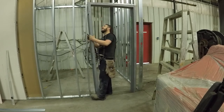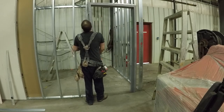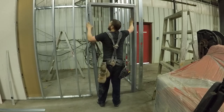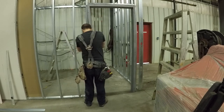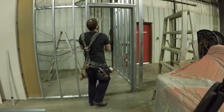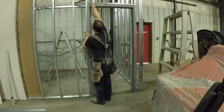When I'm also framing, I don't screw in the bottom of the door stud — that's not the hinge side, the other one, the non-hinge side. We'll call it the handle side. I do not screw that in when I'm framing so that I can move it when I'm getting the door in, and there's not gonna be a bunch of holes when I want to screw it back in. That is a good little hack to know. Popping the door in shouldn't be too much of an issue when you're framing correctly.